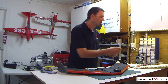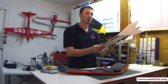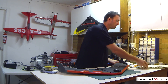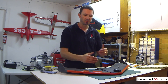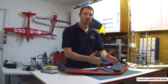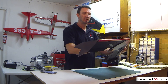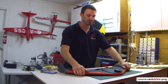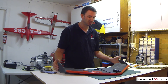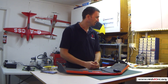What I did was I took the original Microwing design — a foam board wing with the KFM3 step, so three layers. I made it the same span, made it slightly deeper to give a bit more surface area, put a bartonose section in the middle and turned it into a KFM7. That's one step on the bottom and two on the top to give it an asymmetrical section. It's actually just white foam board, painted, because I wanted it to look good.